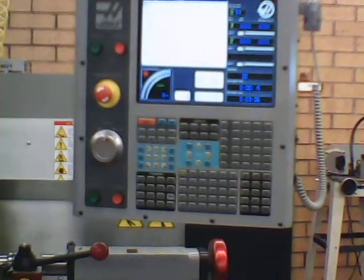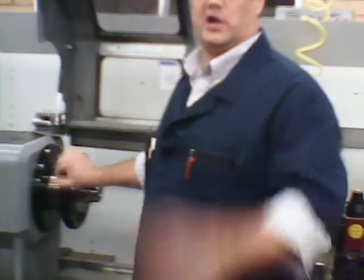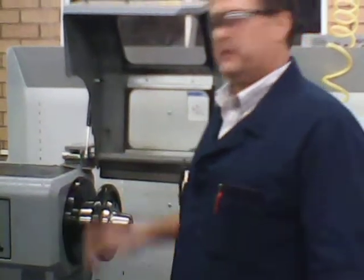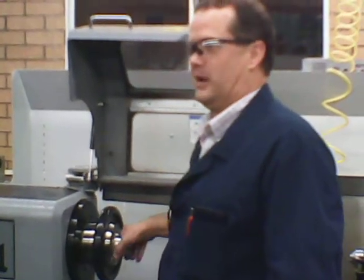Normally you wouldn't want to turn the spindle on if your chuck wasn't clamped on something, but this one we don't have 3 jaws, because the jaws will actually work their way out and come flying out at you. Yes, I have seen it happen too. I've seen just about everything happen.